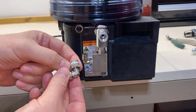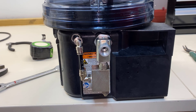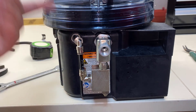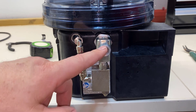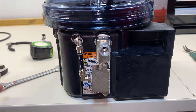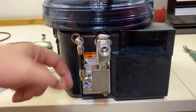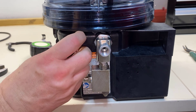Now in our kit there's one more of these elbows with the sealing ring, so it doesn't need any thread sealant either. When you see these in the field you'll see a lot of different arrangements of the way that the little piece of quarter-inch tubing is done — some people have it come back and loop around, or have this 90 degrees from where I have it. I like to keep it as short as possible: you don't want the fitting interfering with other tubing or hoses, and the shorter it is, the simpler it is and the less it's going to be damaged. So I cut a piece of tubing that's two-and-a-quarter inches long, and a lot of that is already inside the fittings, so you can finger-tighten the swivel fitting.